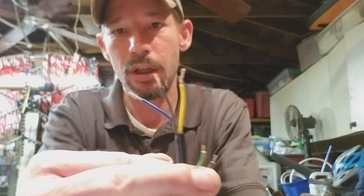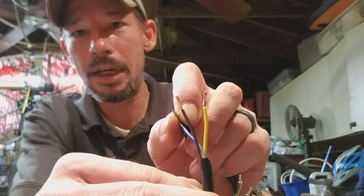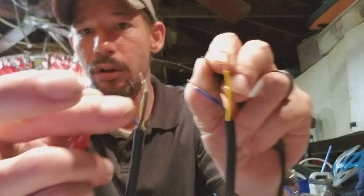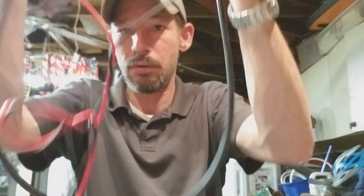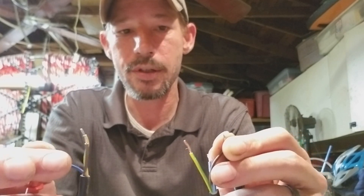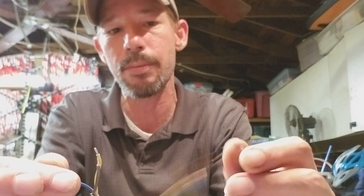What happened today with this particular pigtail caused me headaches all day long. I connected blue here and blue here — got nothing. In my setup, brown is V-positive. When I connected blue here to brown here, I actually got a reading, showing that what I thought was data was actually power. Same setup, same connection — they were crossed somewhere within the internal wiring of the actual pigtail itself.